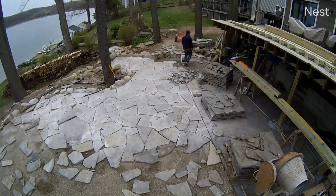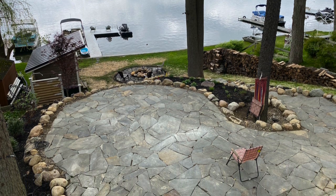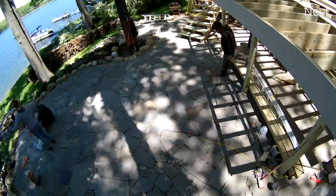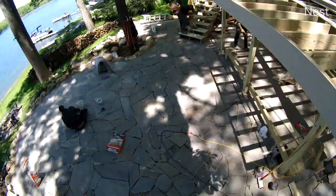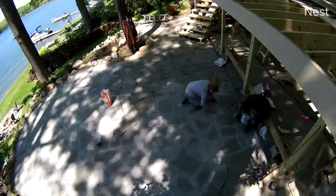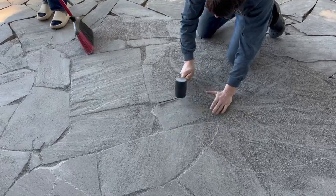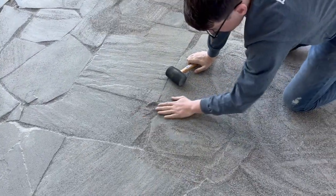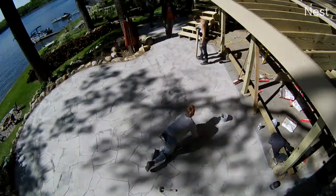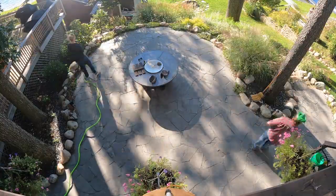This goes on for another two days — it took me about four to five days to get it all in, but the final result is pretty awesome looking. Next step: polymeric sand. This is a really important step — without it the patio won't be solid and will start to crack. We're using Gator Dust polymeric sand. As you add the sand in, tap with a rubber mallet the whole time so it settles all the way into the crack, not just sitting on top. Brush off all excess, then hit it with a leaf blower to get the dust off. Start hosing from the lowest point and work your way up.